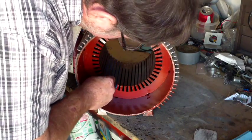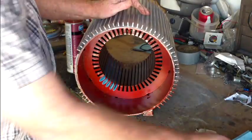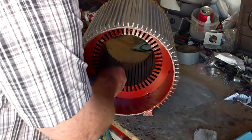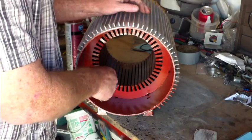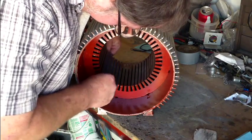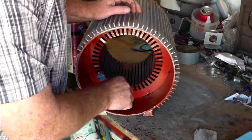This is the new wind. This wind is going to be 24 wires in hand, one turn, wound for four poles. This is going to lower the voltage down to about 25 volts because we do windings for the Curtis controller — the 1238 series controller.